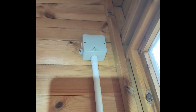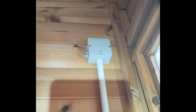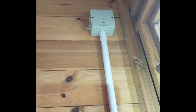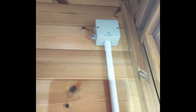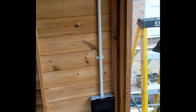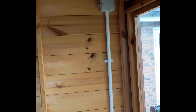I've used tough cable by the way, not SWA on this — I find it easier to use on this kind of job. So there's tough cable on the outside running into the junction box, then singles with Wagos in that junction box, down to the socket. So that's the summer house section of the job done. I'll show you how the cables run into the garage.